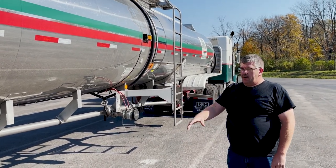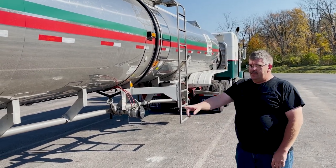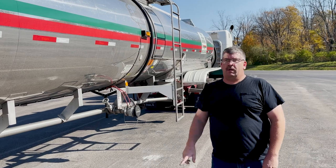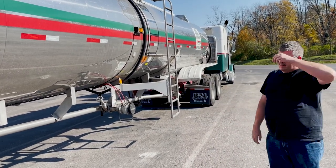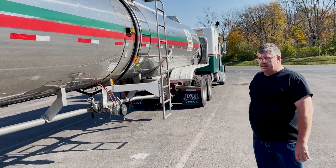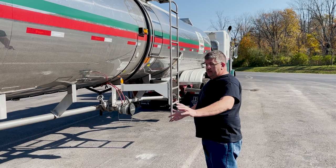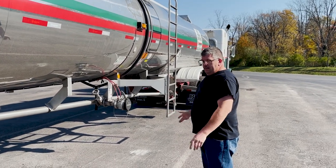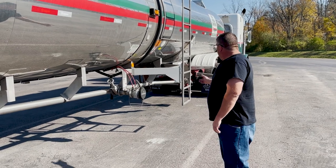If you come across oil dripping down the inside of the tires or the brakes look wet, that's indicative of an inner wheel seal that's blown. That needs to be written up and taken out of service, because it pretty much makes the effectiveness of the braking at that wheel position pretty much zero. So you need to make sure your brakes are dry, oil-free, contaminant-free.